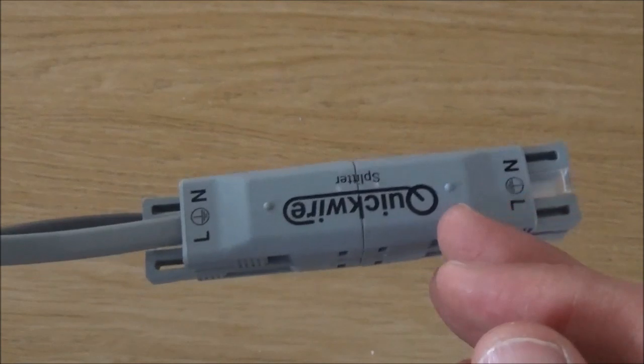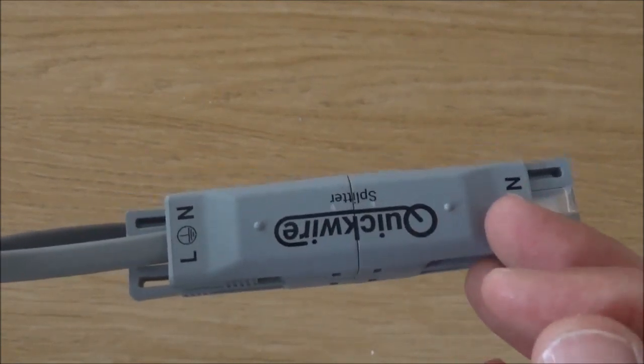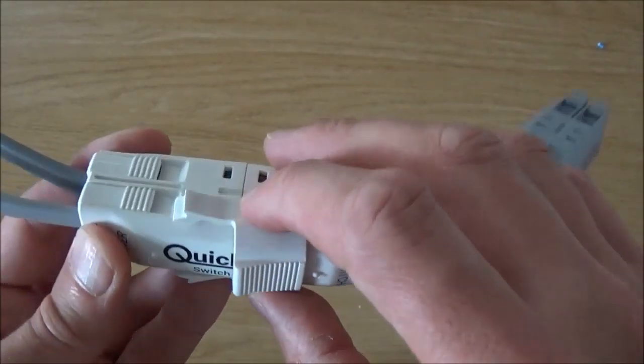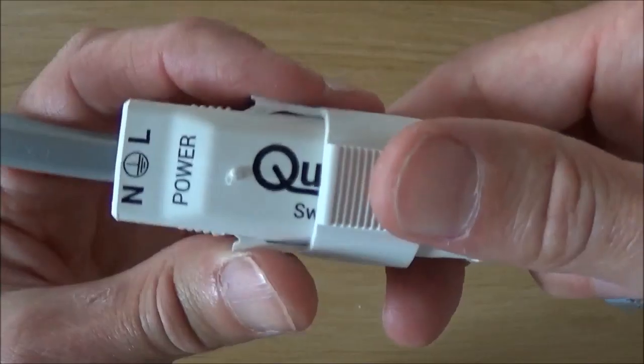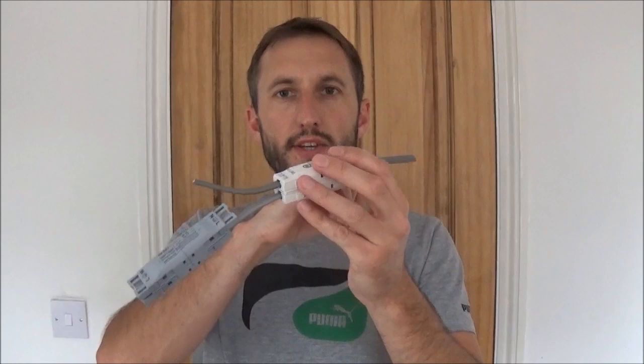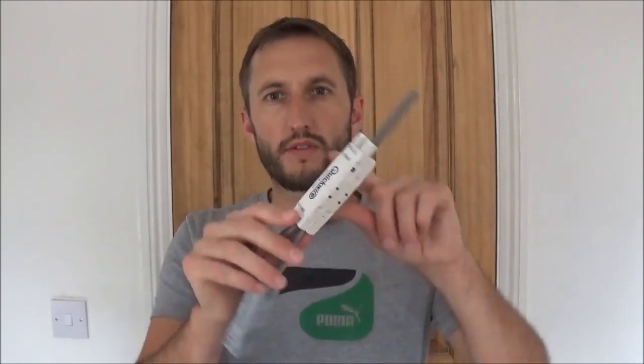Please bear in mind when adding lots of lights to a circuit that the cable you're using is safe to take the load to the lights. If you want to release any cables, you need to use the tool which comes supplied with the junction box or the splitter. You do this by placing the tool over the top of the junction box, placing these bits behind the little levers to secure them in place, then putting your thumb on the top, pushing, and it slides out so you can remove the cable. Bear in mind that if you're working on a house that already has these installed and you don't have the tool, you're not going to be able to get them out to inspect — you'll have to cut it and put in a new junction box.